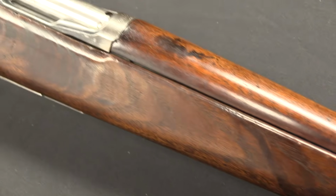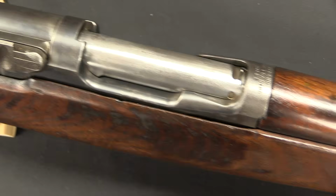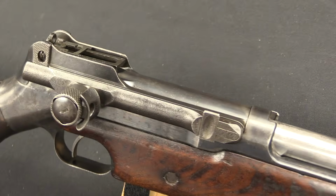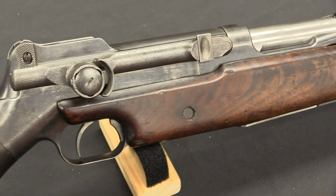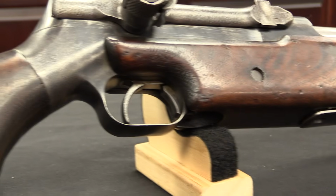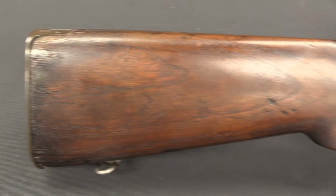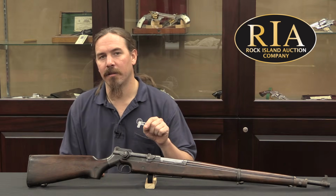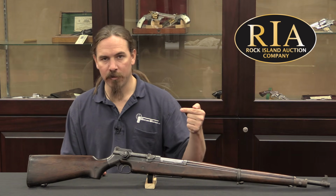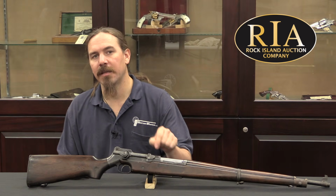The idea is, in a primer actuated rifle, when you fire, the pressure in the cartridge actually pushes the primer backwards out of the pocket in the cartridge case. If you think about it, you have the potential already, just in a regular cartridge, to already have a moving piston system, that being the primer. Now, today, we're used to the idea of, if the primer starts moving or gets flattened, that's a sign of dangerous pressure. But in Garand's design, there was actually basically a very small piston in the bolt face. And so the primer was able to move backwards and it would push this piston with it. That would unlock the system and then allow the bolt to cycle.